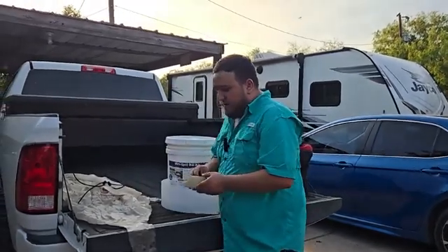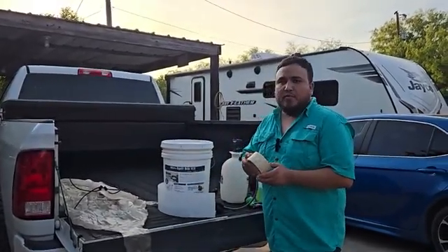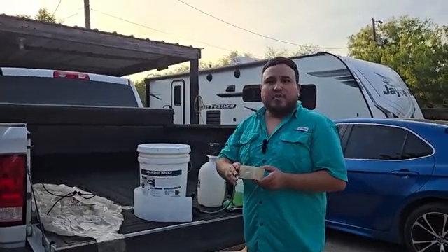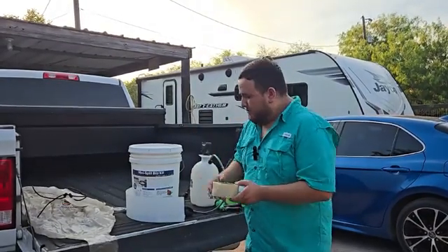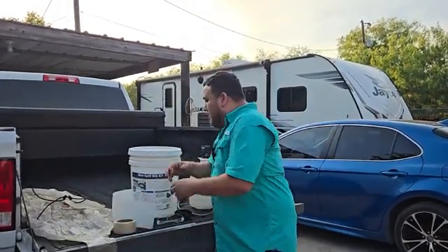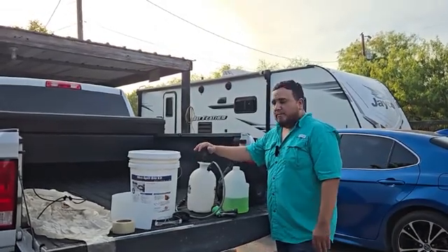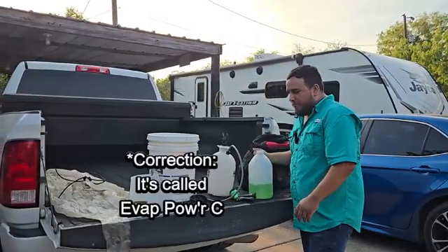Also, you have this special tape right here. What we'll use this tape for is to cover all the electrical area so we can keep it clean and dry whenever we're washing the indoor system or giving it maintenance. Also, what I'm going to use is this ordinary garden sprayer right here and this chemical cleaner — it's TriPower. This TriPower is good for evaporator coils.